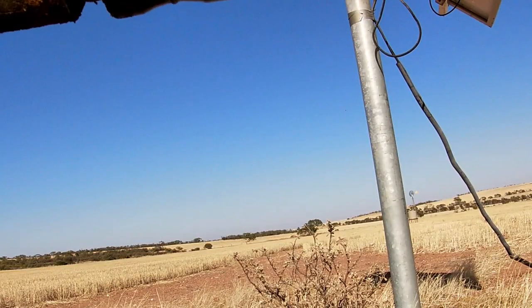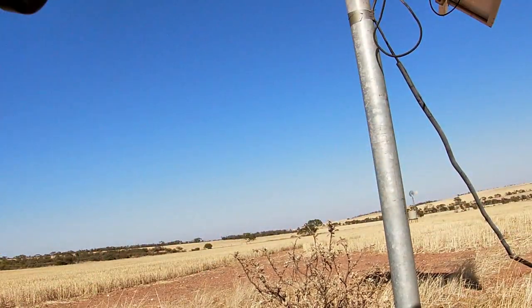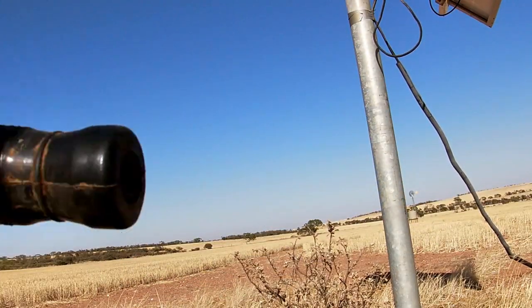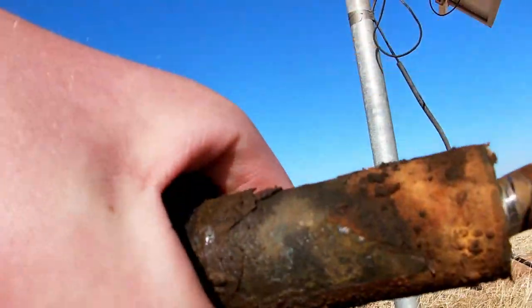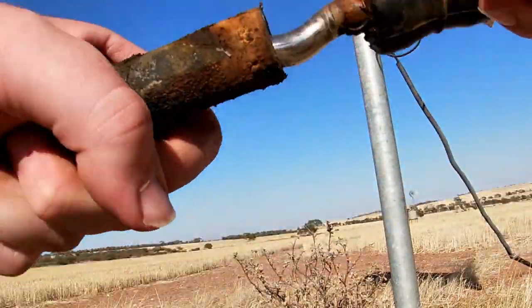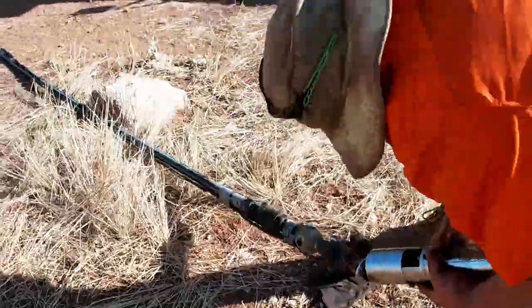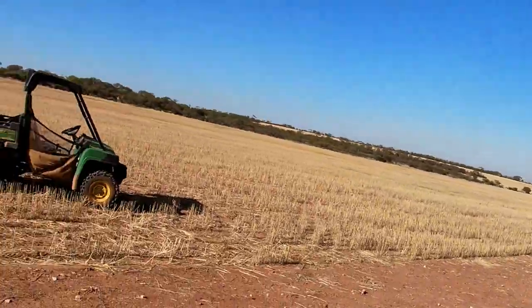So the motor, which Dad is trying to fix off screen here, drives the rotor, and this helps to pump water up the pipe and out of the well to one of our water troughs and tank. But the problem with this one, as you can see, is it is quite rusted out, and it is also very difficult to turn. That's because it's seized. And what Dad is trying to do right now is put the new rotor in the motor so the motor can drive the rotor to pump the water through this pipe and off to the tank.